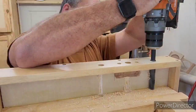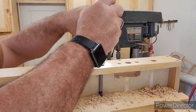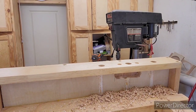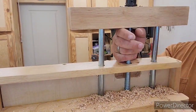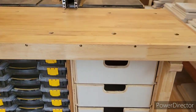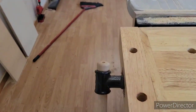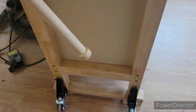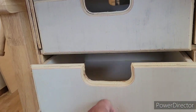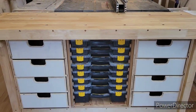All we had left to do was come back and drill out for the clamp — a couple of half-inch holes — then re-drill the dog holes at three-quarter inch. The finish on the tabletop coming out of the box wasn't the best; there were some scuffed spots, so I sanded the whole thing down and put on a coat of wipe-on poly. I'm very happy with the way this turned out. If you like this kind of project, give me a thumbs up. Think about hitting that subscribe button — if I could get enough subscribers, I could justify spending more time on build videos. I've shot a dozen of them but never finished editing them because it takes so much time. But this one I really like the way it came out.